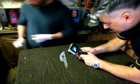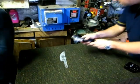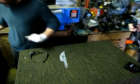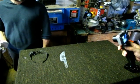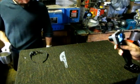Okay, so the blade's been buffed and cleaned. So now what we're going to do is add a second layer to it. This is where you need to start thinking about the depth of your design and what areas you want raised, and which areas you want deeper.